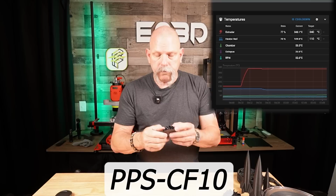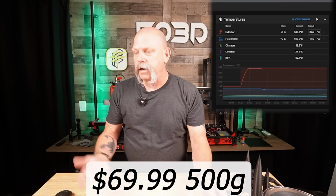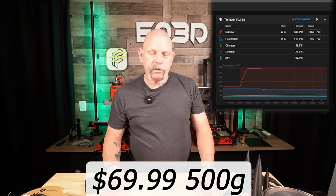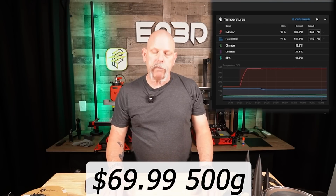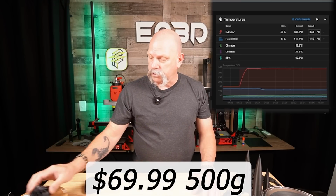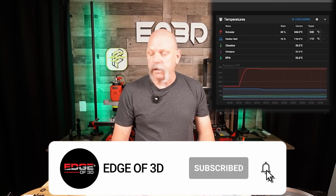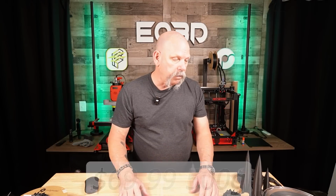But that's the PPS-CF, and again, $69.99 for 500 grams makes it $140 a kilogram. So it's not something just to buy and print stuff with. You got to really have a use case for this. Parts for your car, injection molding dies, anything like that. I mean, what can I say? It's as good as metal.